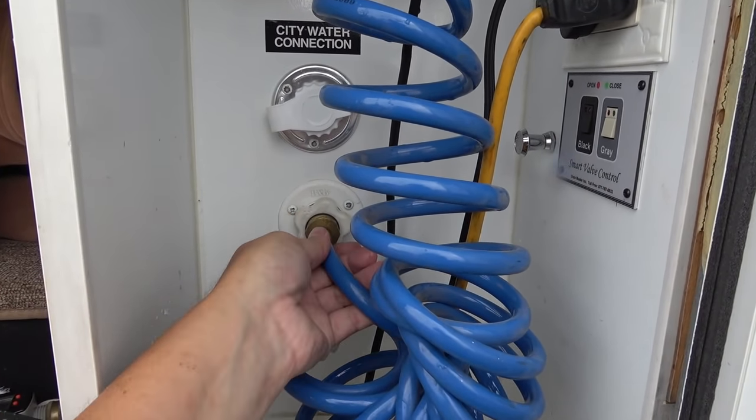And also, you can winterize your RV in other ways. You can, of course, do the old antifreeze method. And even when you use this, you're going to have to put a little bit of antifreeze in the P-traps. It doesn't blow out the drains or anything. And some people use compressors or bicycle pumps, all sorts of other ways. The one nice thing about this is once you turn it on, it automatically turns itself on and off. So you can go around just as one person. You don't have to say, is it going, and then turn it on and run back and forth or have a helper. So that's one advantage of it. So I give it a thumbs up for that and kind of a thumbs down for the cost.